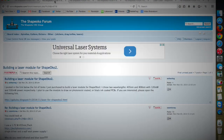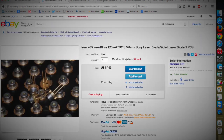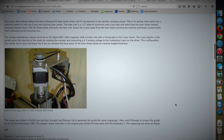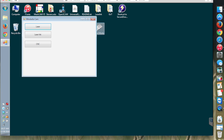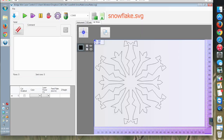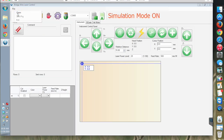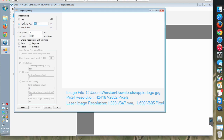Laser upgrade kits already exist, and if you're feeling ambitious, you can even source all of the parts individually to save some money. What makes LaserInk interesting is the software package called ObjectWorks. With this software, you have a one-stop shop where you can import images, create G-code, and stream G-code. You can create programs for raster engraving images or line following with SVG files. From within the same program, you can access basic CNC controls like manual jogging. You can also use the software to stream G-code generated elsewhere, as you might do for CNC milling.